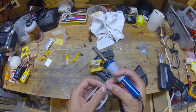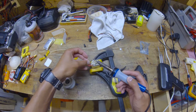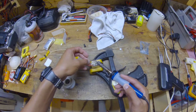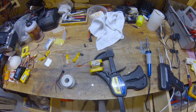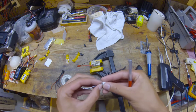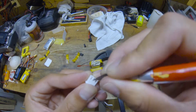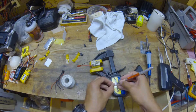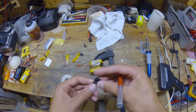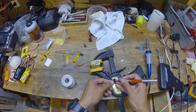And then we have negative on the other side. For the balance lead, I have this balance lead here, so we're going to take the wires out. Now we're going to take the nice silicone wires from the old balance plug — we only need three because we're doing a 2S — and we're going to steal them from here.